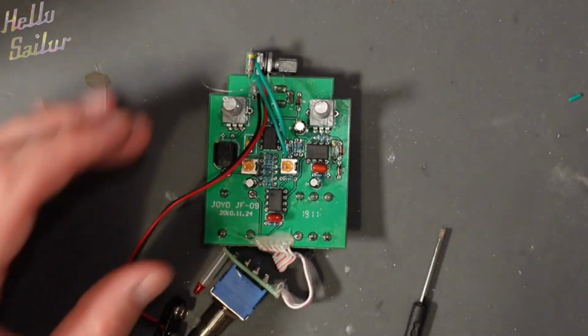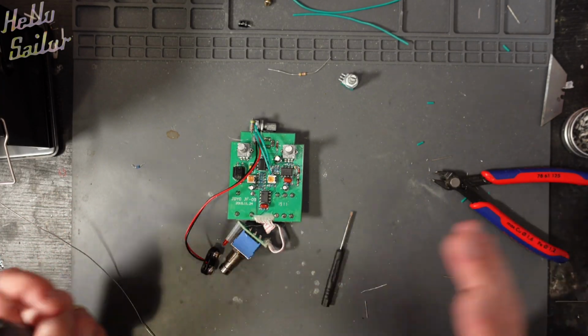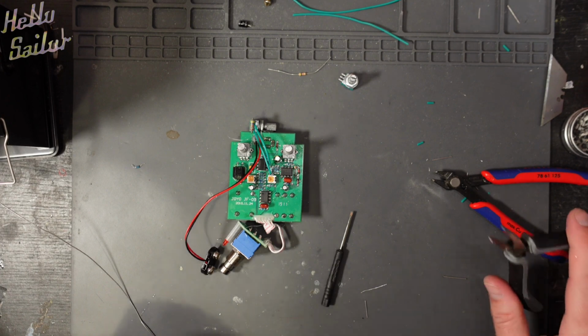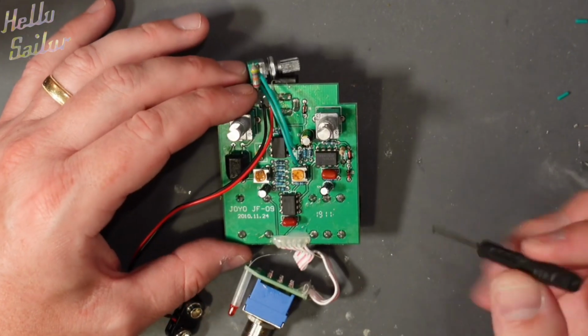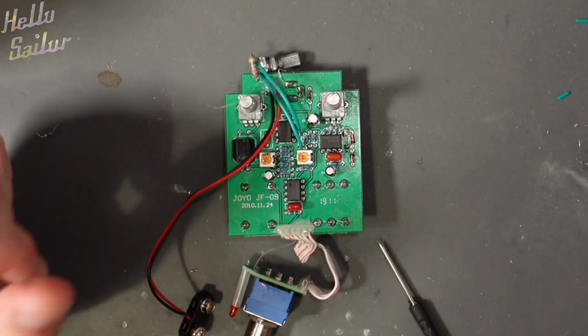It does say to go ahead and test the pedal now. I'm not going to do that, mainly because I've got to pick my daughter up from school in approximately 25 minutes and I want to get this done beforehand. Moving on. The next mod is to remove C6, which is located here, and replace it with nothing. So I'm going to go ahead and do that.